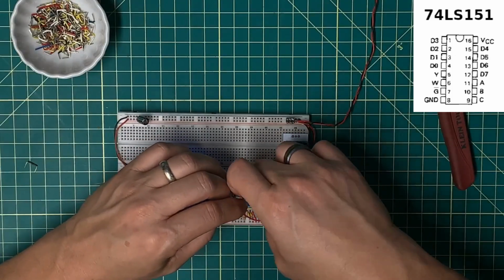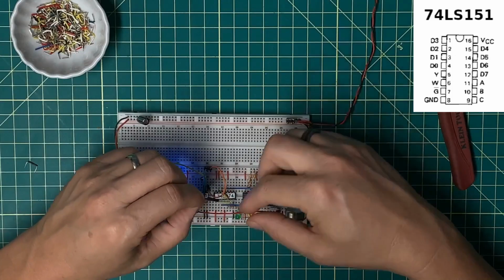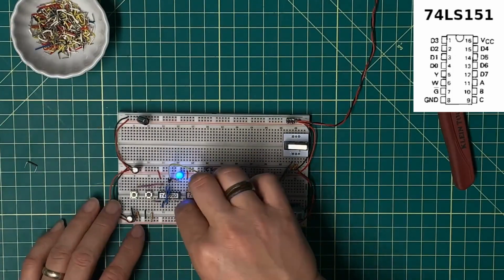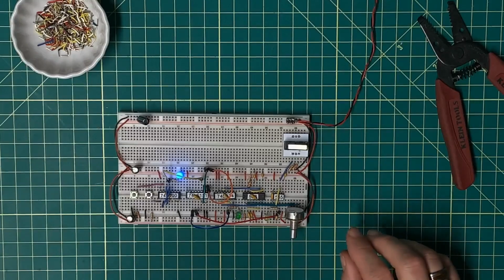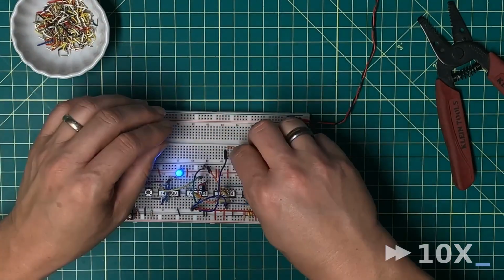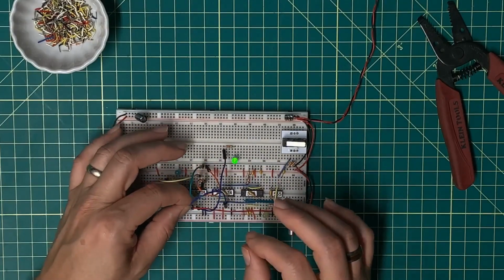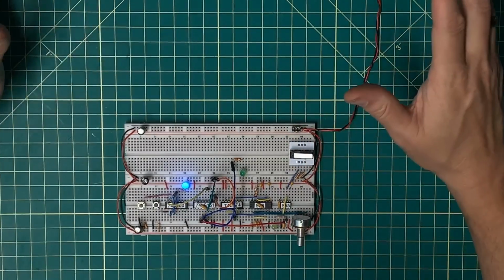The stepped clock output is from pin 3, and that's going to go to D0. The next one over, D1, will be off the bottom 555 timer here, which is going through this divider. So that's going to be its input. The other six options are all tied low, and I will get those during cleanup. But my output here is going to be on Y, and I will pull this up here. Okay, I have those backwards. So step and run. That's a quick fix here. Swap these two lines. So step and run. Okay, I'm pretty sure some of this is going to change, but let me get this cleaned up and at least organized for now.